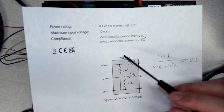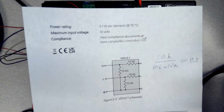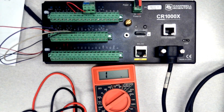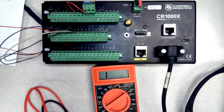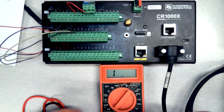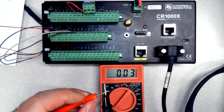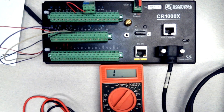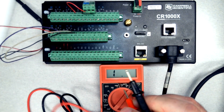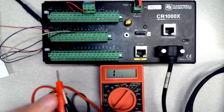We're going to look at this side of the voltage divider and check both those 10 kilo-ohm resistors. I've got my meter switched on and I'm going to put it on the 20 kilo-ohm range because that will cover the 10 kilo-ohm resistor I'm measuring. I'll touch my probes together to make sure it's working — it will drop near zero because the probes are low resistance. I'm going to measure from that H to that H to measure this first resistor.